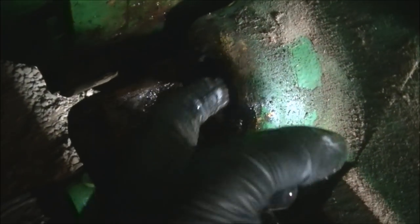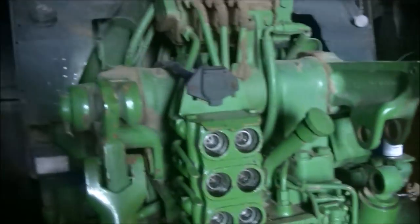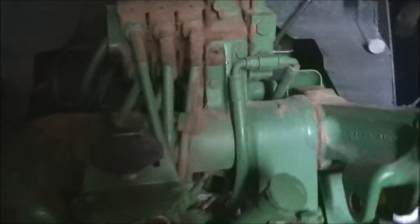We're going to be putting a new pin on each side. Once we got the cylinders unhooked, just like I said, we can move the arms freely — we're actually moving them by hand. The arms are all free. Those three tubes of grease I put in over the summer on the zerks that I added definitely seem to help. Ryan and I can move everything with the cylinders unhooked, just the two of us.